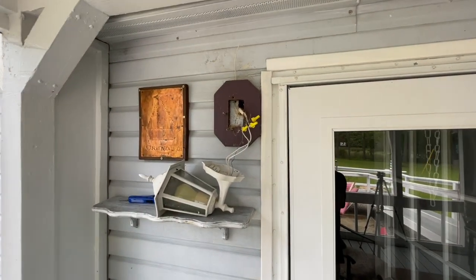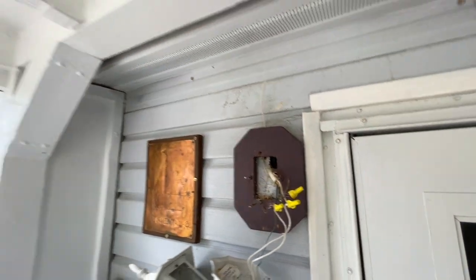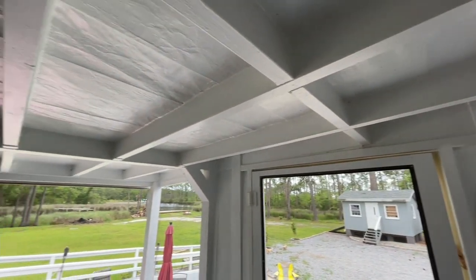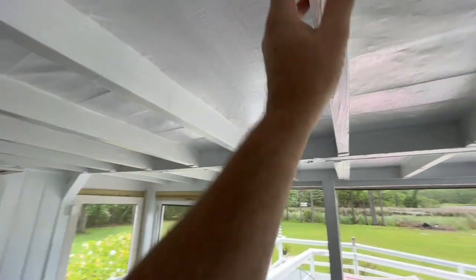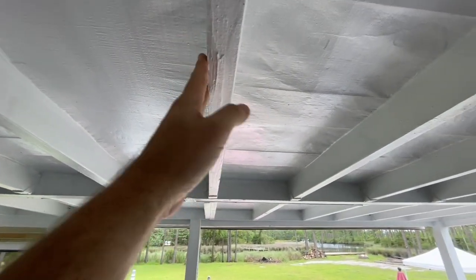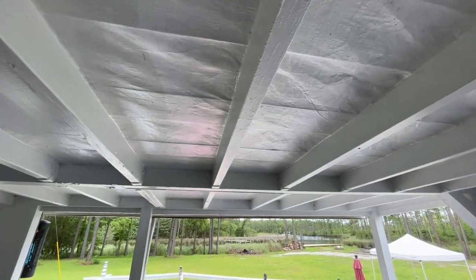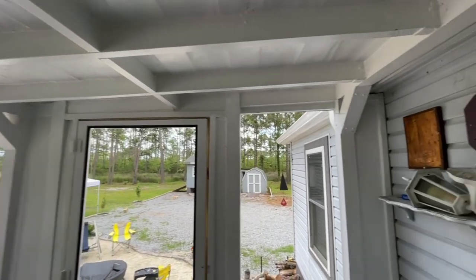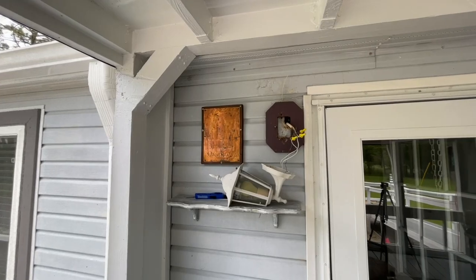What I'm going to do is put some conduit in that will run from the top of the sconce across the ceiling to approximately where I'll put the box. I'll be feeding wire through it as I go, because there are going to be some pretty tight corners, and even with the sweeps it would be hard to pull wire through afterward.